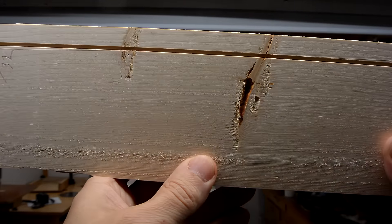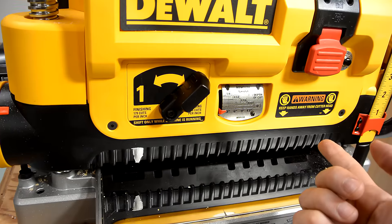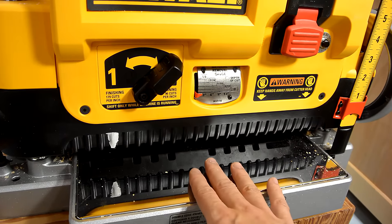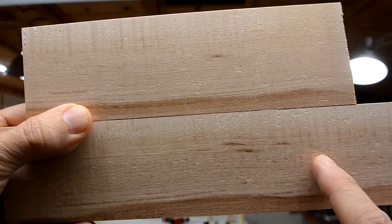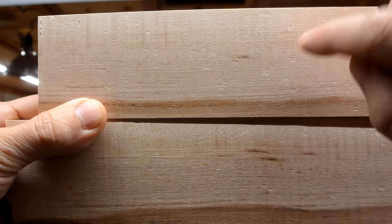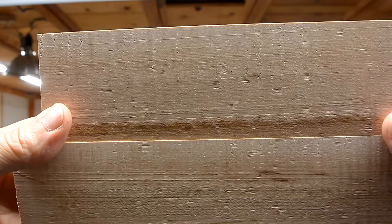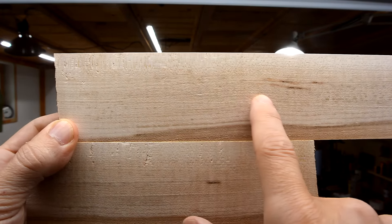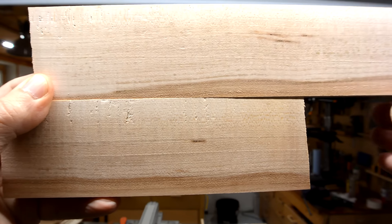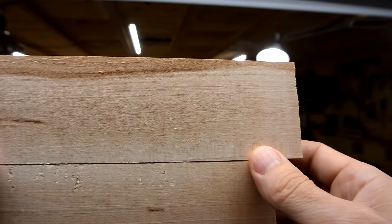Ignore some streaks like here — that's other damage to the knives. There's much less divoting if I set the feed rate to slow speed on the DeWalt, but then it feeds half as fast. What I could do instead is just take two shallow passes instead of one deep one. I've also been experimenting with difficult grains. Planing 3/32nd of an inch on the DeWalt and on the Mastercraft, you can see a little bit of tear-out. Overall, the Mastercraft planer does slightly worse. Trying again with a really shallow pass — less divoting but still getting a little bit of tear-out. The Mastercraft planer is slightly worse, and at slow speed on the DeWalt I don't see any more tear-out.